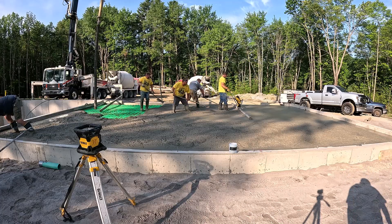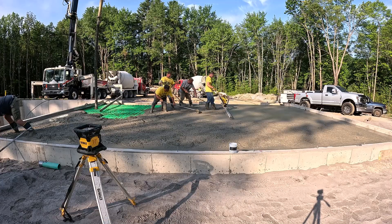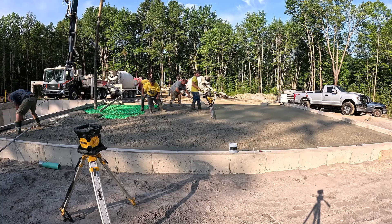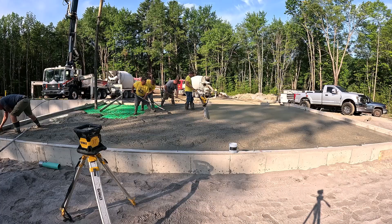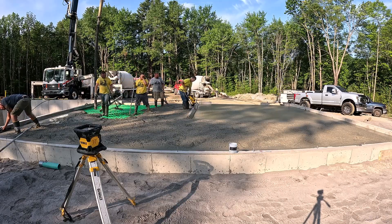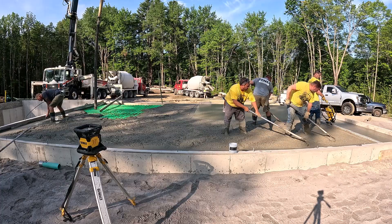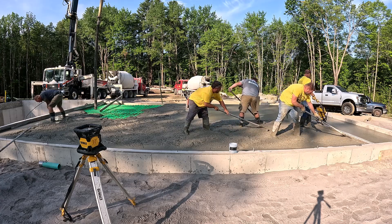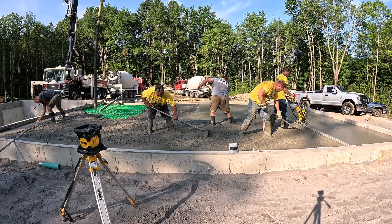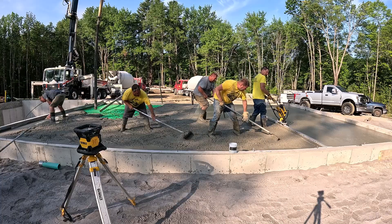And that's doing basically a floor a day, five days a week. In order to get your concrete floors flat — or even with a slight slope to the center like this one — you want to go at about that speed and let your rakers do most of the work. Get the concrete to the level it needs to be, then just pull the power screed over the top. I'm basically just focusing on my two ends, making sure they're touching the pads so I know I'm right at the level I need to be. Luke and Darren are up towards the front raking, and Eric's just behind them pulling out any high spots so we can keep going from one end of the pad to the other.